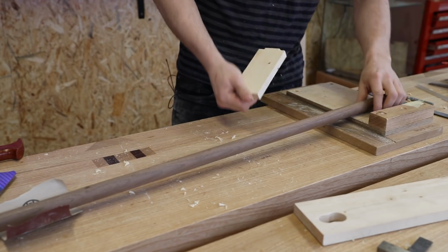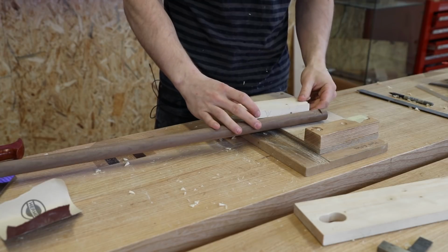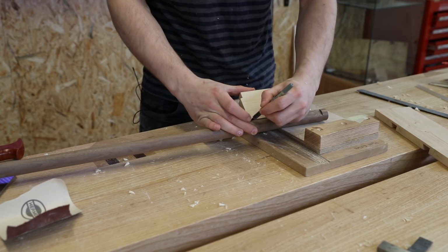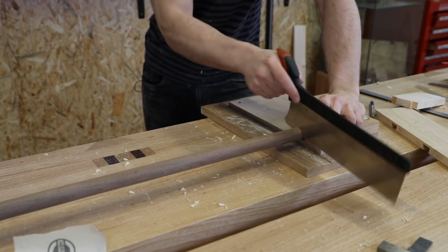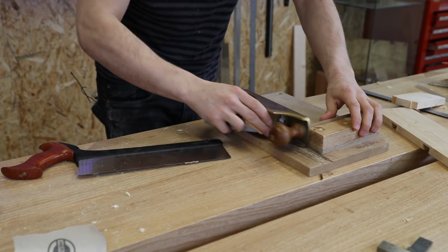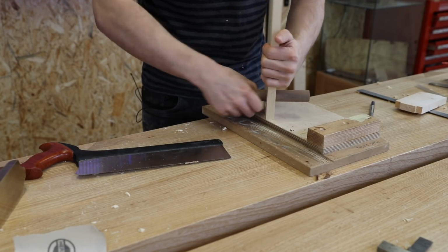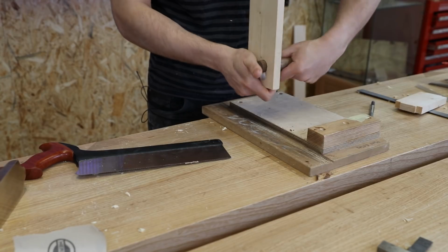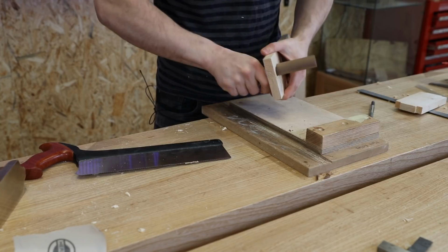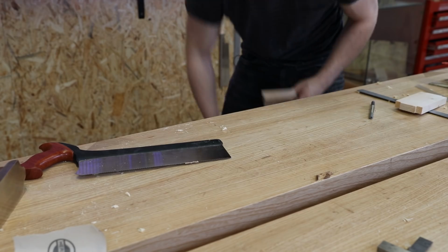So now I'm going to cut the dowel to its final length, I reckon. So from the inside of that notch, it's going to be the size of one of the shelves plus another 5 millimeters or so to nest into that opposite component. So we'll do it oversized to start with, and then we'll test the fit after we've glued it all together. Still need to loosen the fit a bit to make a bog roll change a little bit quicker and easier. So otherwise you're just going to end up ripping this thing off the wall every time you need to get more paper off. Mind you, at least you could fix the plasterboard while doing a number 2 at the same time.